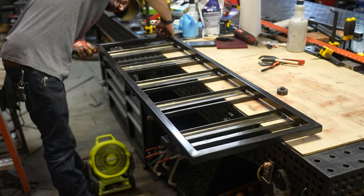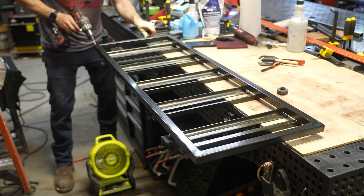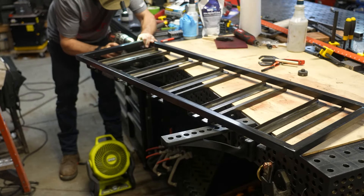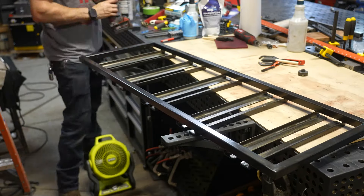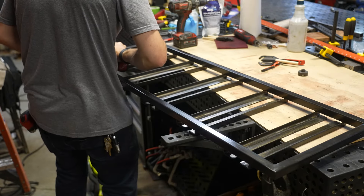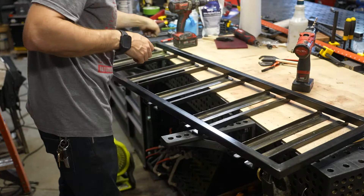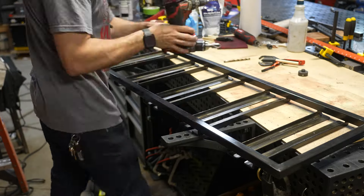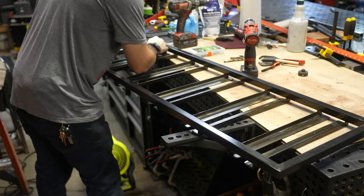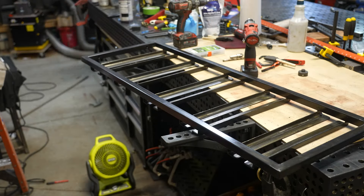The piece of glass is three-eighths with a beveled edge — I got it from Dulles Glass and Mirror in Texas, a great resource for nice thick glass in a custom size in a really short amount of time. The way I'm going to mount this is by putting 3/16ths holes through the outside edge of the steel and then a larger hole that the head of the screw can poke through, so when you install this you don't actually see the heads of the screws at all. I use a little bit of Sharpie to clean up that shiny edge where my drill was, then an air compressor to blow it off before bringing it over to the client's house for install.